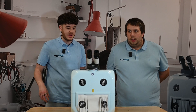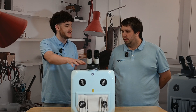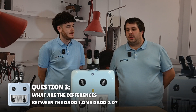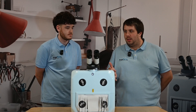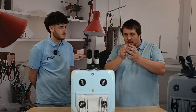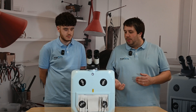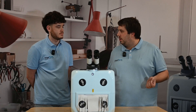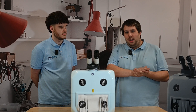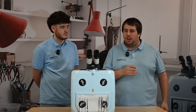Obviously the Dado can cover so many jobs, but what are the differences? This is version 2.0 — what are the differences between the Dado 1 and the Dado 2? The Dado 2 firstly has 50% more power, which is a big thing, especially when you're working on silver. Silver is really conductive, so when you fire the laser at the metal it dissipates the energy out rather than holding it where you fire it — so you do need that extra power. It's also got 25 power settings instead of 12, so it's more versatile. Power 1 on the Dado 2 is actually lighter, which is really good because those finer jobs are that much easier.